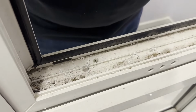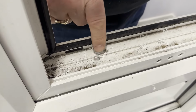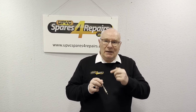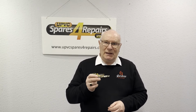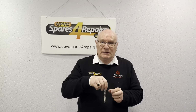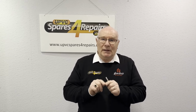So now we've got a 10mm hole, but it's only in this side of the profile. So now we're going to have to open up inside in the other side of the profile to get another 10mm hole further in. Once you've opened up the hole with the cone bit, we usually would recommend that you go through the second layer of PVC to be able to expose the metalwork below by going in with a 10mm bit, but this time, because it's only plastic you're going through, you can rotate it by hand or use a pair of mole grips to hold it to be able to turn the drill bit, which will then open the 10mm area for both the first layer that you've drilled along with the second layer below.